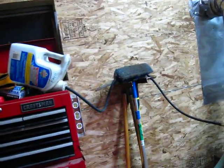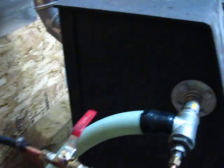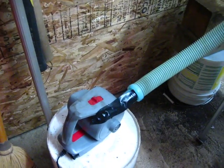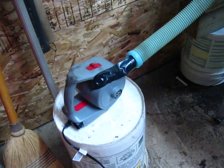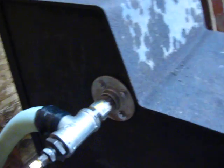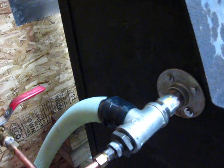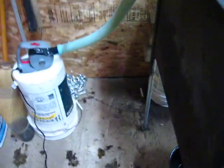This is a drip feed waste oil burner. The waste oil is stored in a container here, the hose goes down, and there's just a ball valve and a T. We have forced draft using a mattress pump — I plan on getting something more substantial, but this works for now. The copper tubing goes inside and runs on the inside of the black iron pipe, and the air flows around the outside.